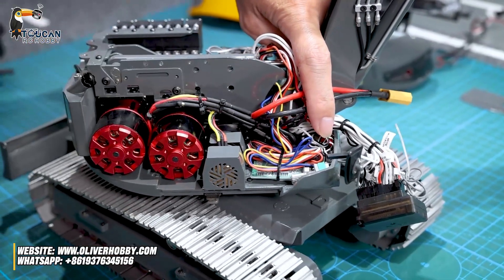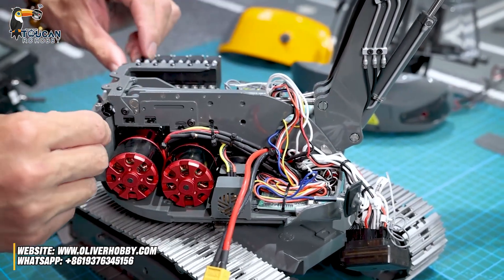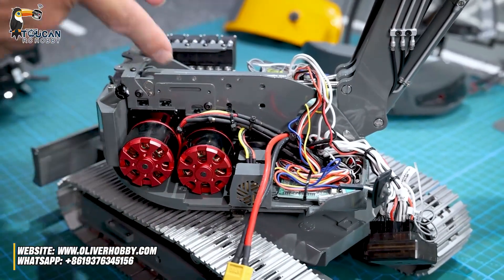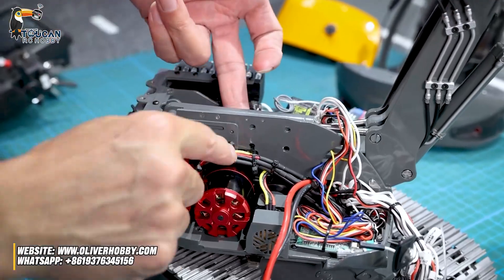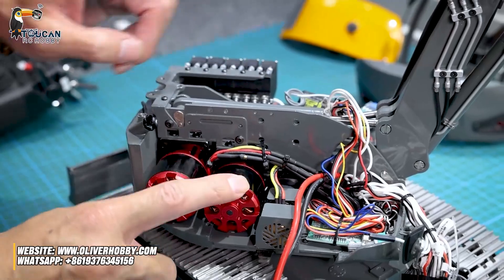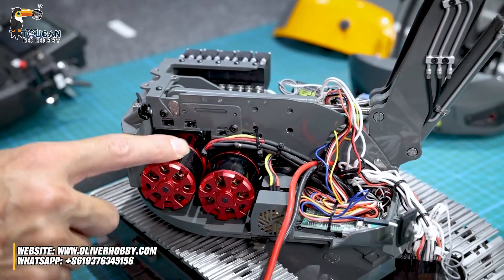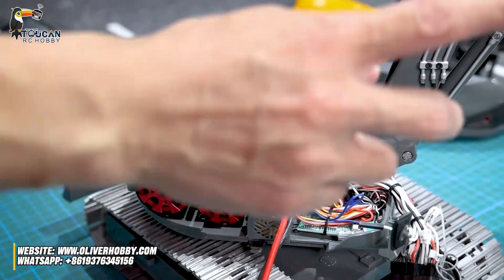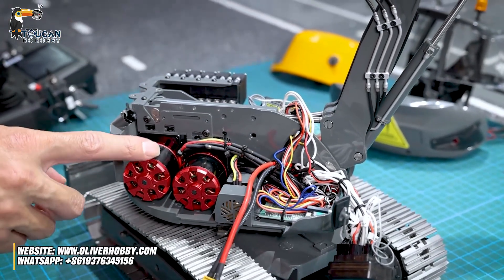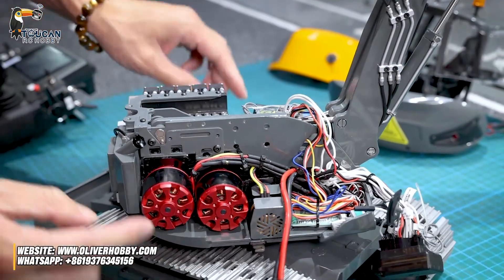And here we have a lying-down motor for rotation. That's the brushless motor for rotation, and the gearbox then goes vertically down with a gear for rotating the bigger ring gear. And that's the pump motor - the pump is under this frame, that's the pump head. The forward motor is from channel 4, pump 1. The rear is from channel 5, pump 2. Pump 1 is for the bigger arm, and quick connection, and the two spare oil channels. And pump 2 is for all other hydraulic functions.